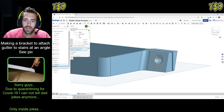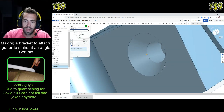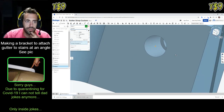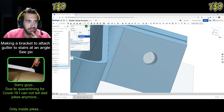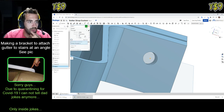Let's show you a countersink though. A countersink hole is going to have that tapered angle. It's an 82 degree angle because that's the standard for a screw. But I'm going to go for just a simple screw. My hole type is definitely a clearance hole. I don't need it to be tapped, which would be threaded. So we'll just have a clearance hole.